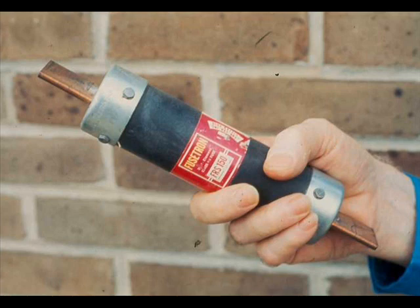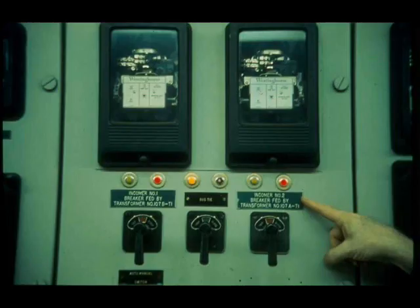In low voltage release protection, the motor starts automatically when the low voltage is corrected. For safety, you must know about any such motors on your unit. When a short circuit or other condition has blown a fuse, first correct the condition, then replace the fuse.